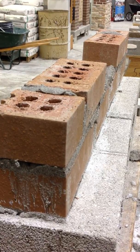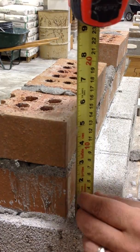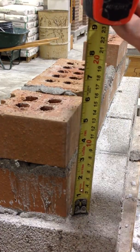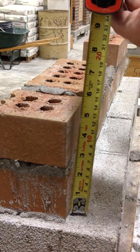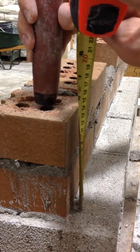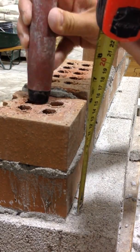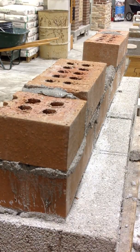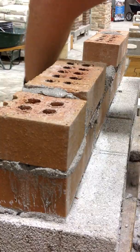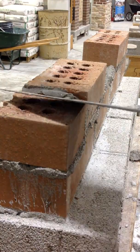Next up, make sure your measurement is proper. It's got to be five and a quarter. I'm a little over five and a half right now. So you've got to tap the end down gently — just stay a little bit above five and a quarter. And now get your four foot level. Get all the excess mortar from the top.